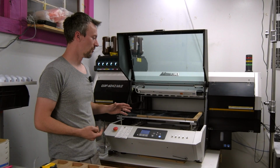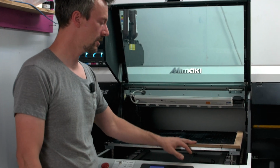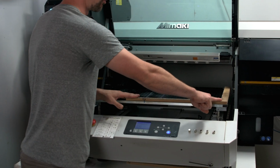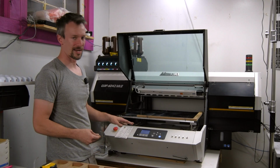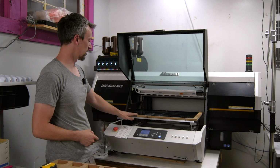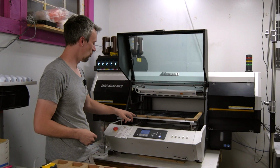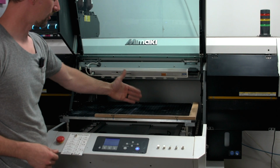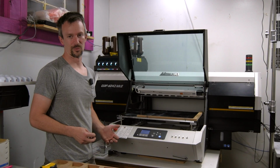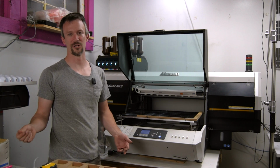So in terms of how we orient all of our print jigs on this printer, we have this fence that we made. Everything, we place it on there and then register it into that bottom right-hand corner. The way that we designed that is we were able to get the machine drawing for the top of this print bed, which calls out the location of every threaded hole, every pin relative to the center lines in the machine, and it also calls out the full print area. That document was kind of difficult to get. We had to contact our distributor, who had to contact Mimaki in Japan.